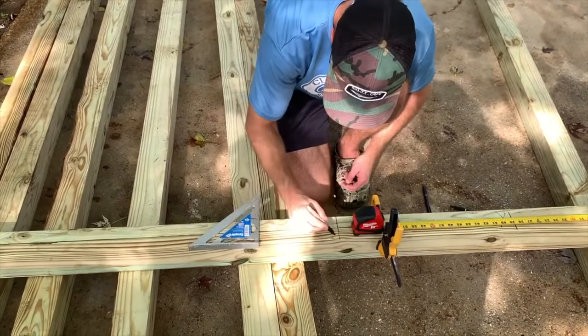When it comes to caulking, basically just think about how water could infiltrate into your shed and cause a problem. So as you can see, I'm installing the caulk around all three sides of the window. I'm not going to caulk at the bottom in the event that any water does get behind the trim, it'll be able to drain out. So make sure you caulk at least all three sides there. And I'm also caulking between the window and the inside of that trim to make sure no water can get underneath. I then repeated this process for the other shed window.